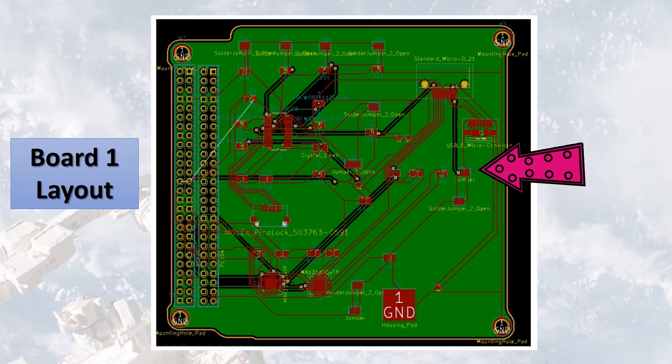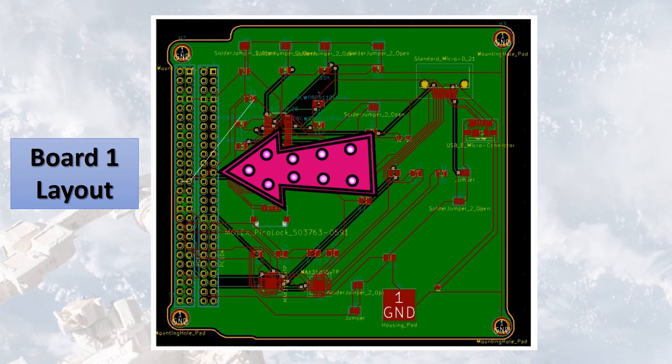Each set of red rectangles represents the copper padding for an electrical connection. The copper sits on precisely one side of a board where either a cable or an actual device will be mounted via some mechanical structure. The two 2x26 arrays of yellow hollow circles on the left represent drill holes for the PC104 stack. This allows for electrical connections to be made between components on different PCBs.